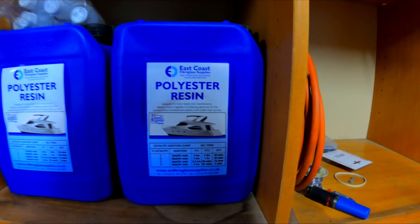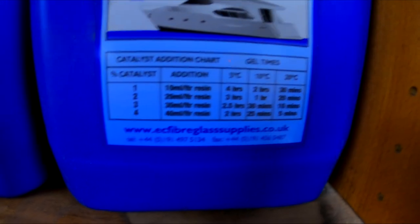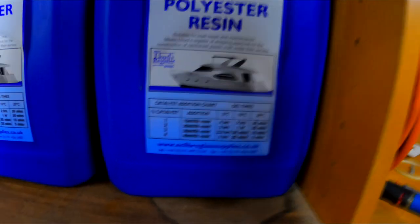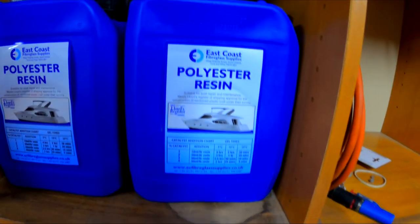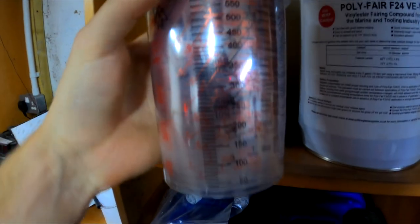For all this fiberglass work I'm going to be using polyester resin - used it on the entire boat so far and I really like this stuff. You can see the different curing times with the catalysts. Normally I add about two percent because at this time of year it's about 12 to 15 degrees, giving me about half an hour of working time. You get the catalyst with it, add it, mix it up. I've got mixing cups with numbers on the side which gives me a nice gauge of how much resin I need, and stir sticks - you'll need loads of them.